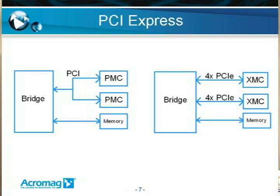The difference with PCIe is that there isn't an interrupt signal. So how do you issue an interrupt in a PCIe bus? The way it's done is with messages. You might think there would be longer latency because you have to form a message and send it off, but in reality it's only about a 100 nanosecond delay, because the messages are formed very quickly and the link is always present — no arbitration is required to gain access to the bus.